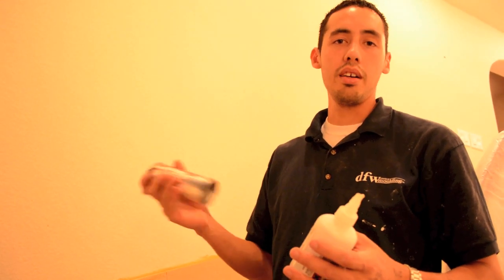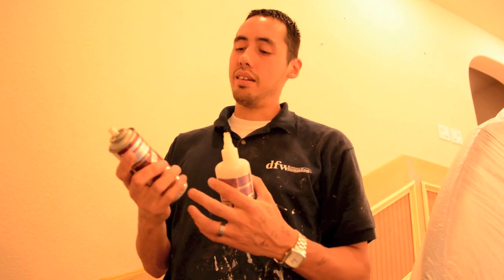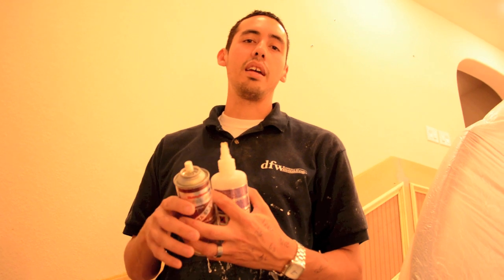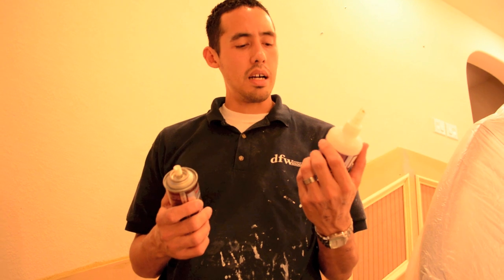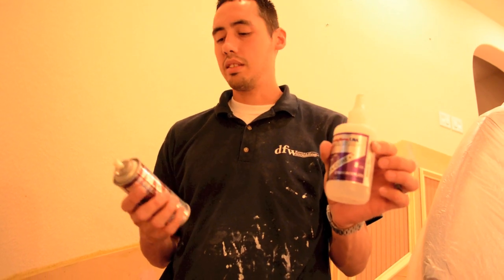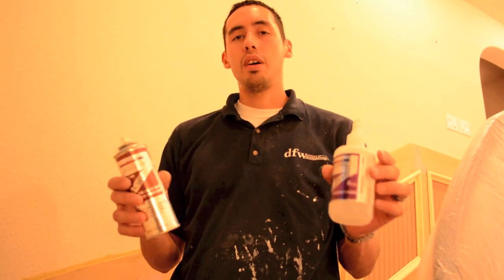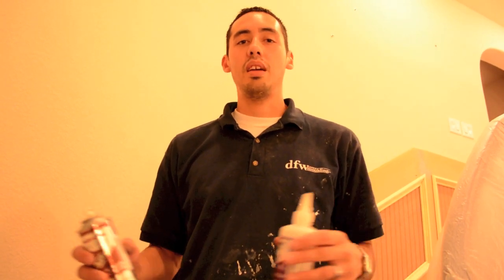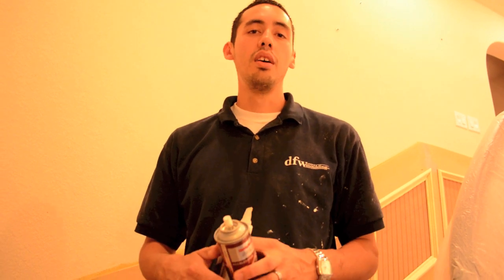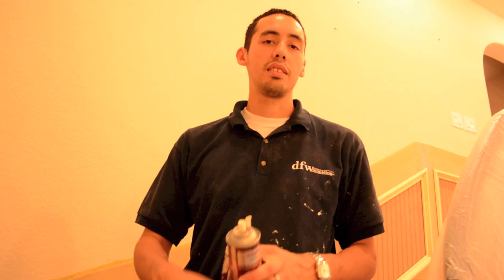They make an aerosol spray — just like a hairspray — and they also make a liquid spray. If you get the liquid spray it's about the same price but I think it runs out a lot faster, so I always get the big aerosol can. These glues run about 30 bucks for the glue bottle and $11.99 for the activator, so you're looking at about $45 with tax for the whole thing. It's a lifesaver though — I use it on all my trim, on everything I can, because it gets all your corners straight. I hope you learned something about working with CA glue — if you have any questions just contact me, and I'll see you next time.